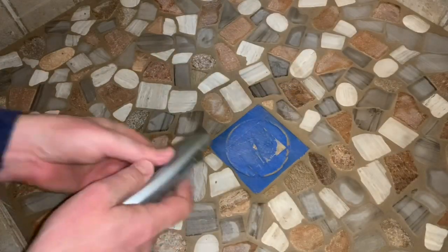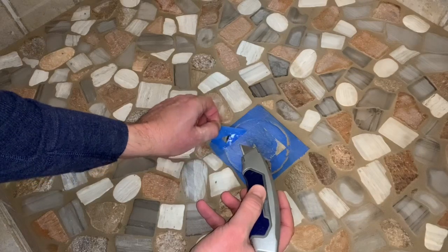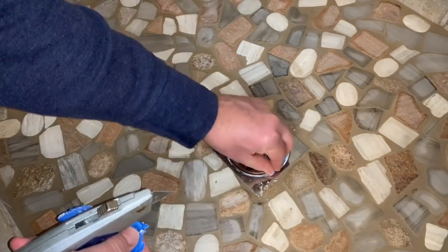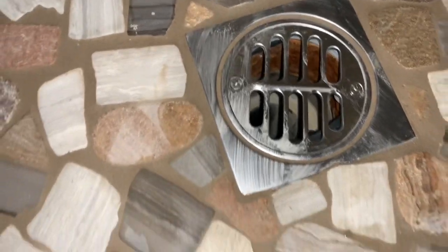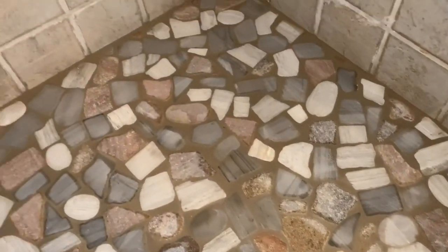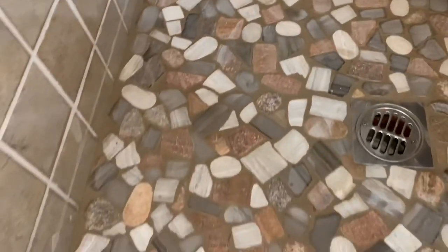One thing I am going to need to clean up is this drain because I've got a lot of tape on it. As I pull it I'm going to need to make it pretty again. Here is the finished product - I buffed out the drain a little bit and filled in the ring. In a little bit I'm going to take a white cloth and just buff the haze that may form on top of these things, but I did put a grout release on them so I may not need to do that. It came out really nice and wasn't that difficult. I hope that video helped you out - if you have any questions or comments leave them in the comment section below. I've got a lot of videos on my channel that will help you out, so give it a look. Don't forget to hit the subscribe button and we will see you next time.